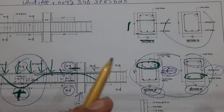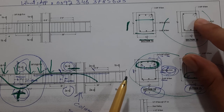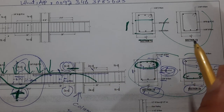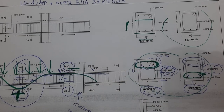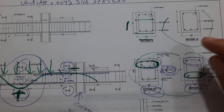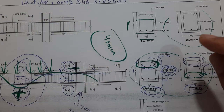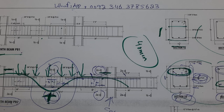The hook should be provided at 135 degrees. The hook length should not be less than 3 inches and hooks should be placed alternately, not all in the same direction. The concrete cover should not be less than 1.5 inches or 40 millimeters. These are the important details of the plinth beam design.